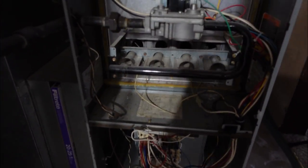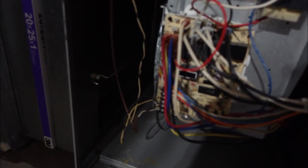The first thing you're going to do is remove your furnace cover and check what connectors you have on your terminal. I have a common 24-volt right at the top where the wires are running, but you can see it's not connected. I also have a W wire, a Y wire connected which is for cooling, a wire to run your fan, and an R terminal. I'm going to connect all four of those.